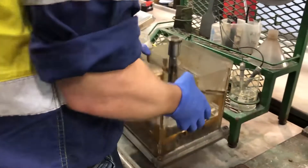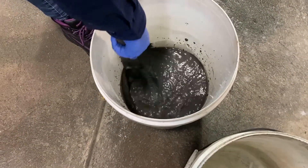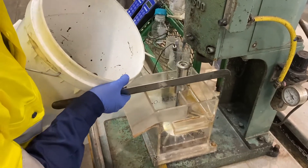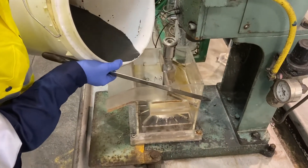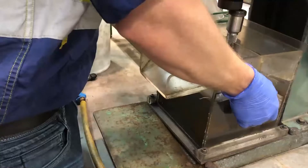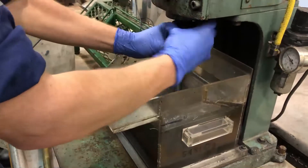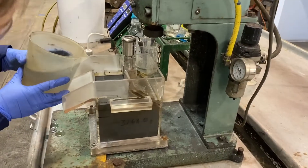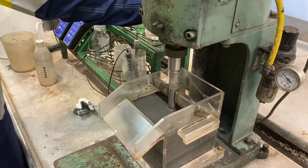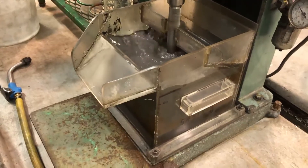Place the mechanical flotation cell on its stand. Agitate the slurry and displace any settled material by using a stirrer. Carefully transfer the sample into the flotation cell, clean the sides of the bucket, and ensure that all the contents of the bucket are added to the cell. Move the cell into place beneath the shaft and connect the agitator. Fill the cell until it is about 20mm below the cell lip. Turn on the agitator to keep the particles suspended in solution, and set the agitator RPM standard for the cell size.